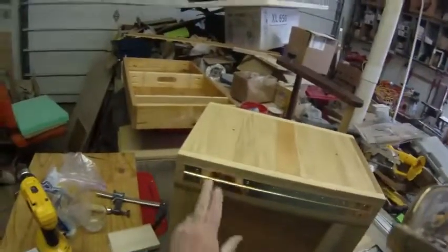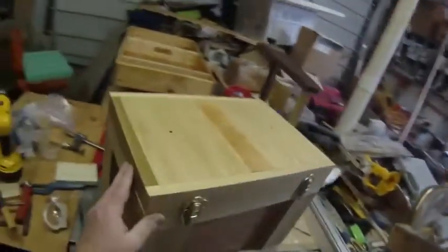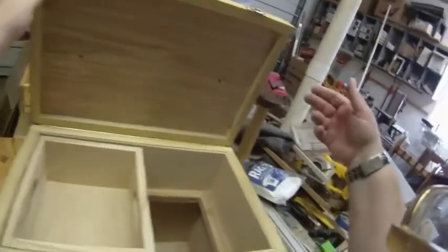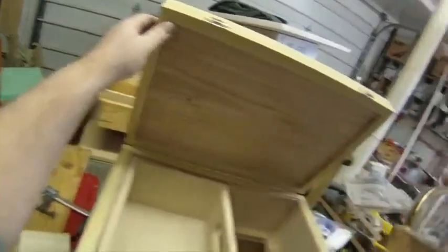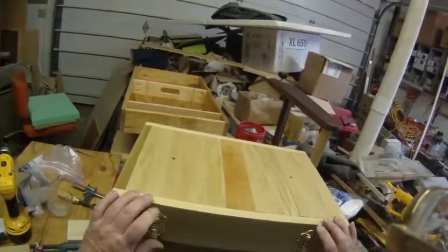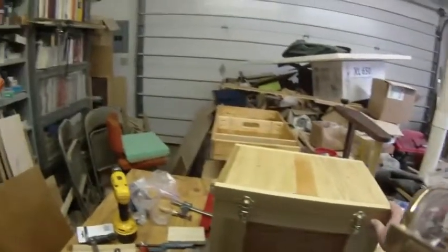Okay, the possibles box is done. Piano hinge cut to length, pilots drilled, screws put in. Around the front, as you can see, we have our draw catches on. And inside, we have our little sliding box. There are some fingerprints in there from finishing — those are just character. I may sand those out just to make it perfect. At any rate, the draw catches work well and keep things nice and snug. I actually had planned to make a template for those, but when I got going on it, I just got going, and it worked out pretty well.